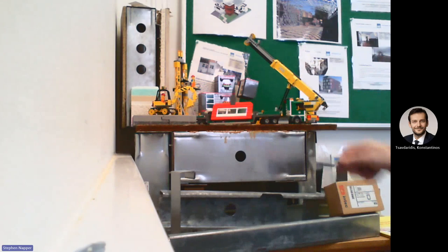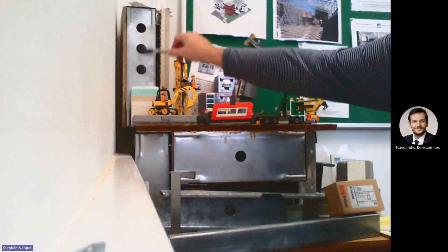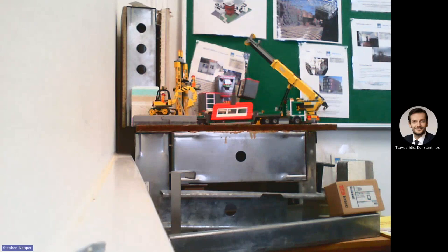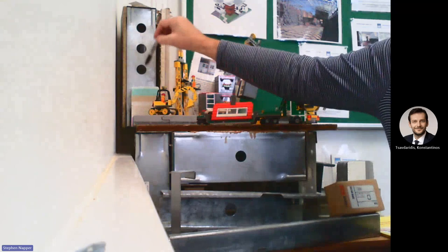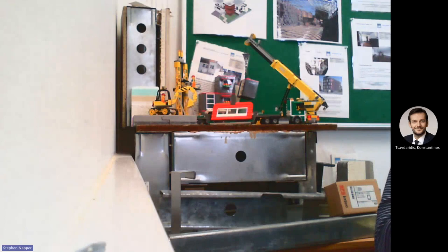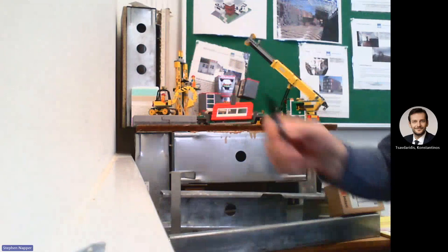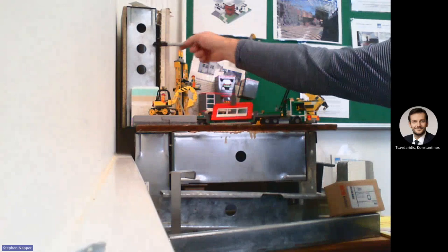We've also got a wall stud and a semi-typical build-up of a cementitious board on the outside for robustness and integrity, and also to stop rodent infestation — rats particularly like to eat the wires and pipes that go through the service holes. If we put a board on it, it acts as a form of racking resistance to stop the building wobbling, and it also stops the little critters getting in. Then we have resilient bars, which are an extra layer, and layers of plasterboard.